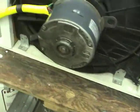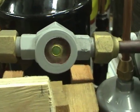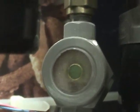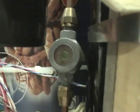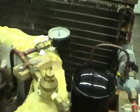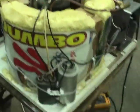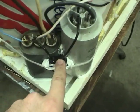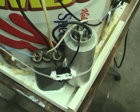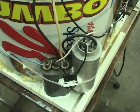The air is getting quite cool already. It's starting to clear out now — there are also bubbles going through the sight glass on the liquid discharge side. The gauge is stabilizing. There are the capacitors — I've got an extra capacitor in parallel with the original one through a PTC to turn it off once the device has started. I found that for some reason this compressor has trouble starting after it's been running for a while at high temperature, and this helps a bit.